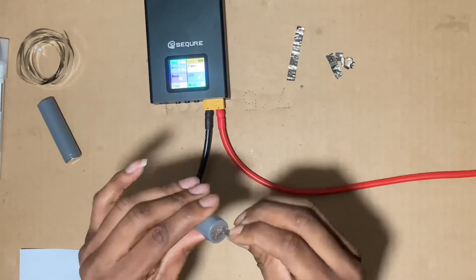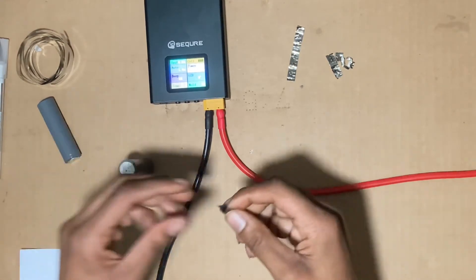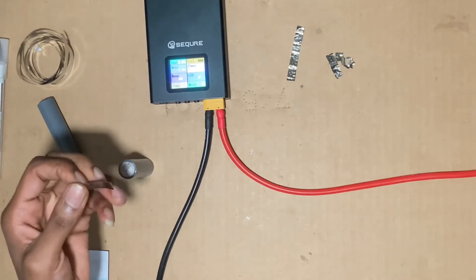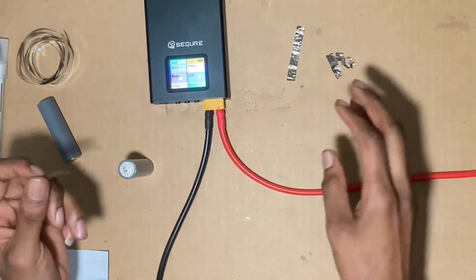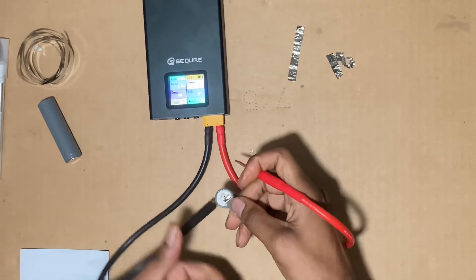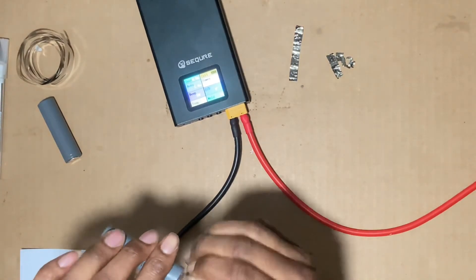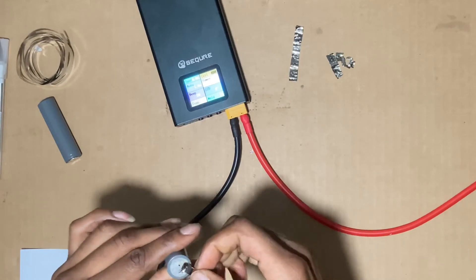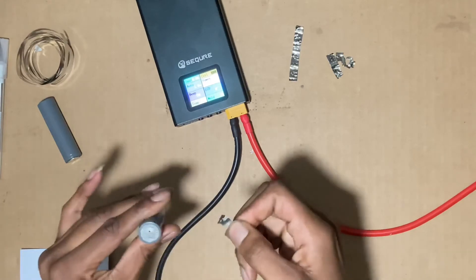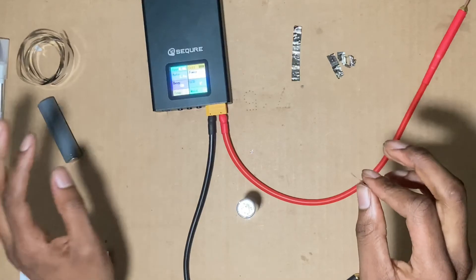We're good. The positive side always has a weaker connection — this is not just with this spot welder, even the one I made too — because the discharge comes from the positive and then transfers to the negative. Boom! The positive connection is still a bit weak, but it's definitely something you can work with going forward.